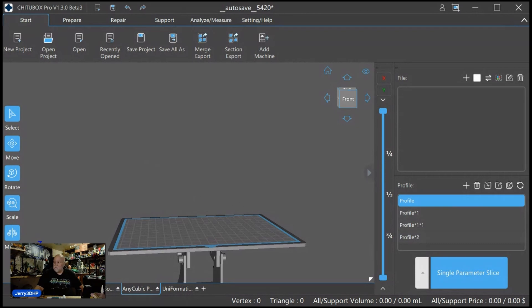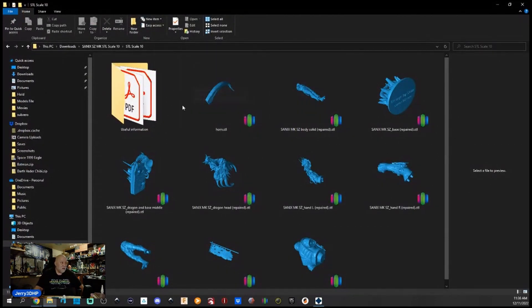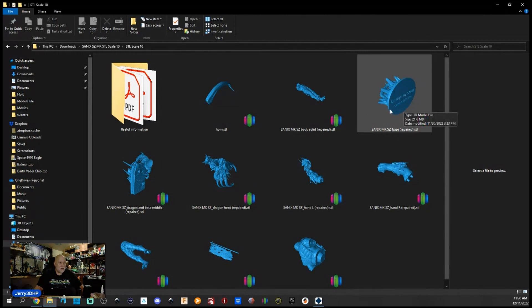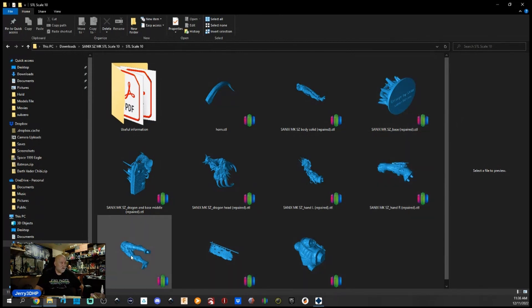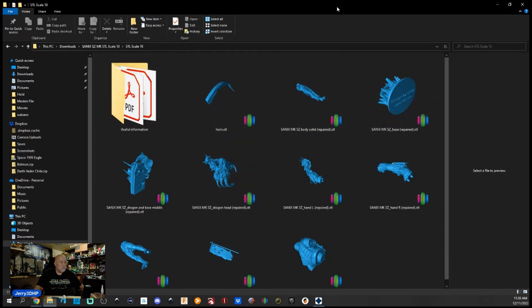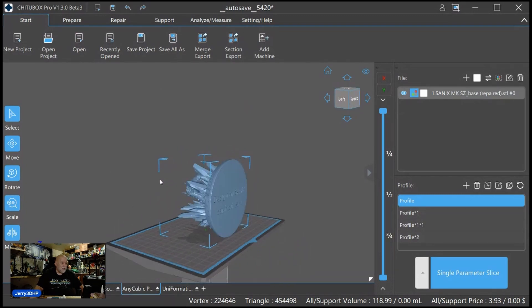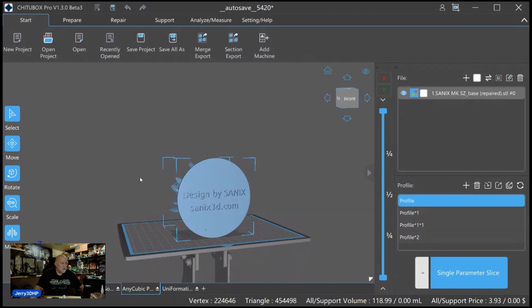When I got down to the last part, the side of the dragon had a big hole in it, so I went back over to the Uniformation for the last part. The way I sized my model — since I wanted to make this bigger — all the models here are one-tenth scale and set up for FDM. I went to the largest part, which is the base, and checked different parts to see how large I could make them to fit on the build surface. Here's the base at 100% scale — I'm going to scale it up to 175 percent.